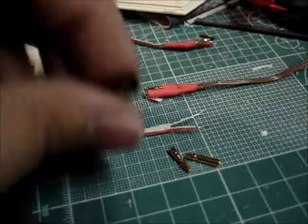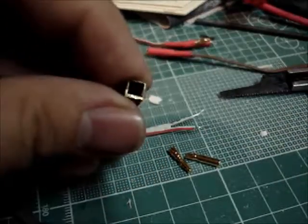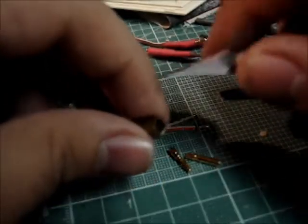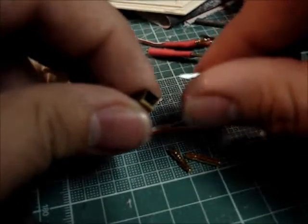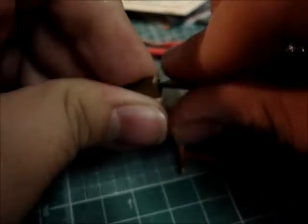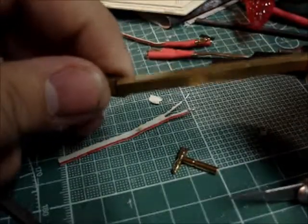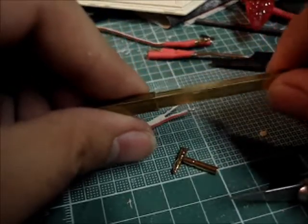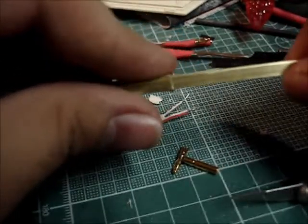Well, okay. Whenever you're cutting a tube, even a square one or a round one, and you're using a saw, like I'm doing, using my razor saw, you're going to have burrs on the inside, and even if you can't see them, they're going to be there because you're putting pressure on the outside of the tube, which makes it shrink down in dimension. So what you want to do is basically just take your X-Acto knife and run it all on the inside like so. Tap out any debris. And after doing that, maybe once or twice, usually no more than once, there we go, you now are able to slide the next smallest size brass tube into it for some cool telescoping action.